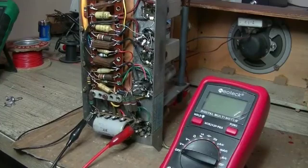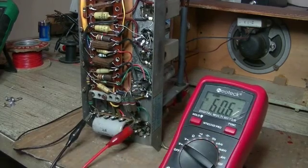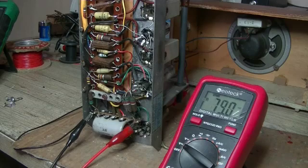I did a quick test on the speaker and the output transformer - they're fine, getting noise out of that. So let's just monitor the main filter cap. I'm looking to see if it's working, if there are any obvious shorts in it, and also to see if the rectifier is working. So far, so good. Current limiter is all quiet. Something's happening - it probably works anyway.